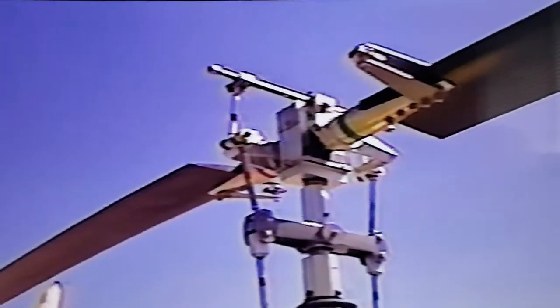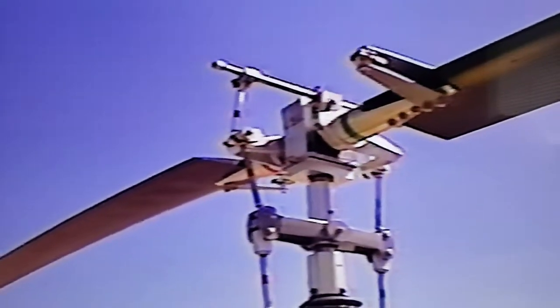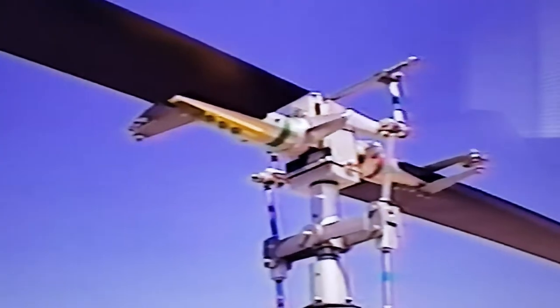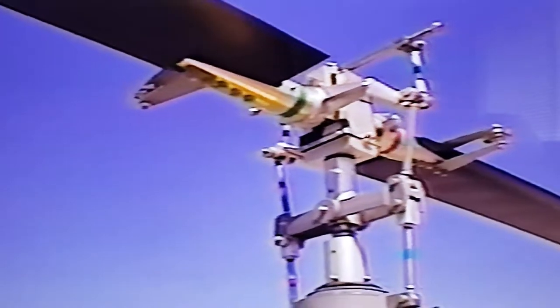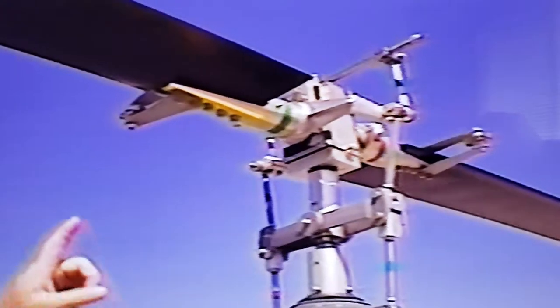We work our cyclic because we're flying the blades and the hub all as one big disc. When we pull collective, you can see this lever goes up — it drops down and we're getting pitch. That pitch is what makes us go vertical, horizontal, backwards, and forwards. The collective's main function is to get the helicopter up and off the ground. It's tied to a series of bell cranks under and behind the seat. When we pull collective, the blade's trailing edge drops down and we bite more air. When we push collective down, the trailing edge goes up and we bite less air.